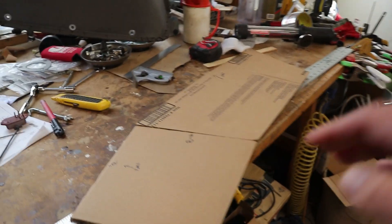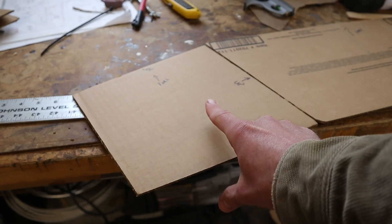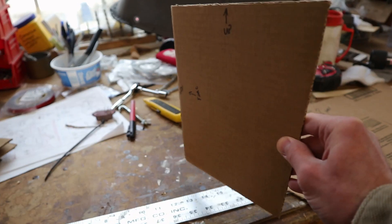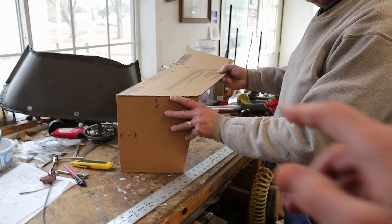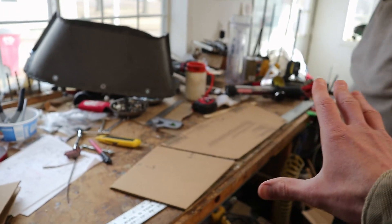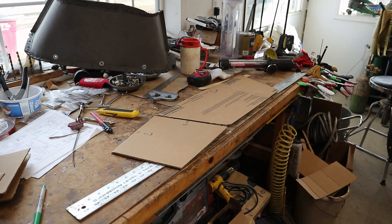Here are our highly technical cardboard templates. It's going to be made of three pieces — the sides are both the same so we only made one of those templates because you can just flip it for either end and make two of those. This template does not include allowances for any of the bends or flanges that we need to put on here — this is just the rough dimensions. Now we're going to transfer that to our material and start getting those allowances added on there and laying everything out.